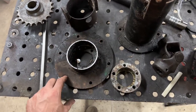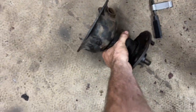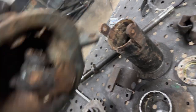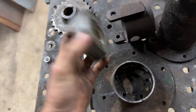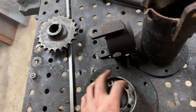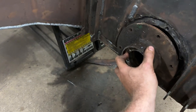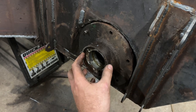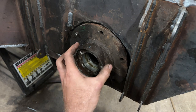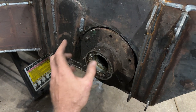For the front, as you can see I trimmed this down drastically and removed this piece off the end of the pipe. This is exactly where the front spindle used to go — you can see the mounting points and that's how it used to turn. This is our pillow block bearings, and as you can see that sits inside — that seals your axle shaft, but this is also a flange face that seals the top from outside elements as well. That goes right here. I do have some clearance issues, which I figured was going to be the case. This is essentially where your stub axle is going to come out — I'm going to clean all this up, make sure it sits really flush, and then just some RTV gasket around there, and we can install our front drive axle. But first we've got to cut that other piece — we're well on our way.